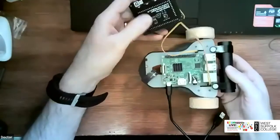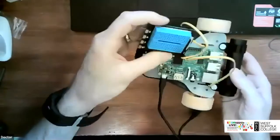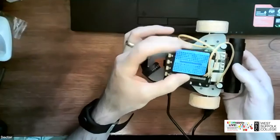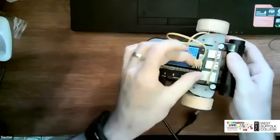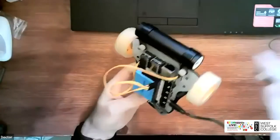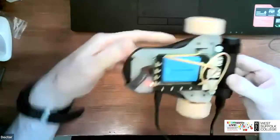And then on top of the Raspberry Pi, I'm using the Explorer HAT Pro, which is a motor driving HAT that also provides lots of inputs and outputs for adding additional electronics. And it has a little area for building circuits with the push fit breadboard on top. So we put that onto the Raspberry Pi, and we're connecting to the two motors. And I'm using one of these USB batteries on the back. So if I plug that in and power it on, then that's now booting up.